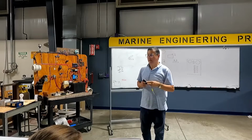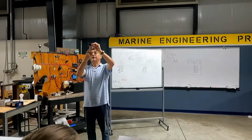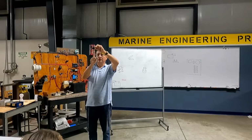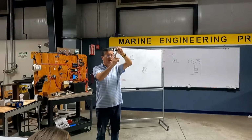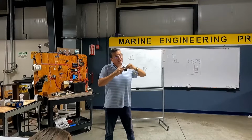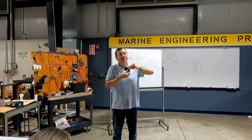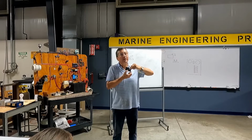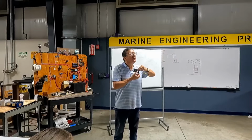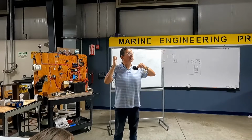Hey guys, follow me. The bilge pump switch is a typical switch with three terminals. One terminal is in the middle for the input, one output, and another output. This switch has one position permanent, and the second position momentary. Momentary is to activate the bilge pump manually. And this one is permanent.